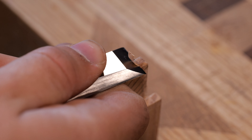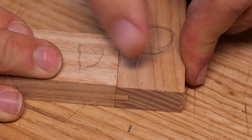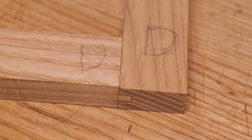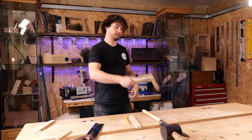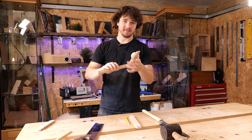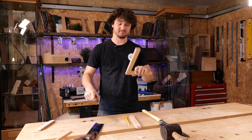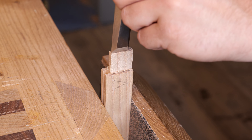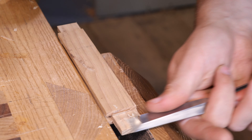It's a little bit closer but not quite there, so I'm going to take a tiny bit off the length of the tenon. Because I've chamfered it I shouldn't need to worry about any breakout on the opposite side. And there it is — with a little bit of clamping force that will completely close up. That dark line you're seeing at the moment is just a very small step creating a shadow; once that's planed off it'll be a lovely joint. A nice friction fit where when you swing it there's not a chance it's coming out — that is achieved from accurate marking out, sharp tools and attention to detail. I'm going to finish off the remaining three and then show you the finished result.